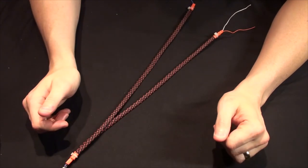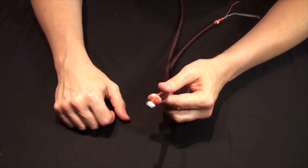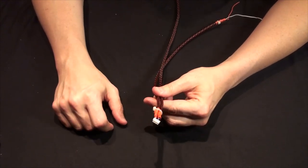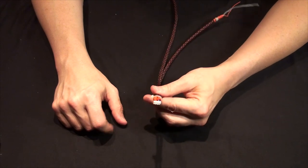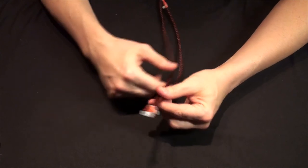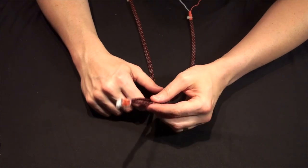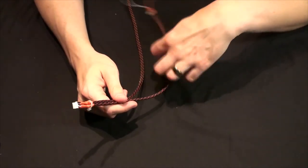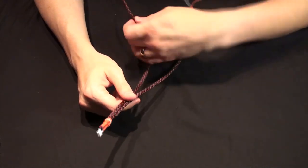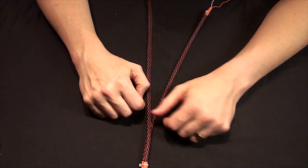Hope that helps if you're interested in creating a turbo button. I believe you could retrofit one of the common L3/R3 touchpad setups, because that is also a JST 4-pin connector. Just keep some of the ends and change the others. Take the first two pins and wire them to your LED, whatever that's going to be. Take the other two, strap them to a button, and you're set.